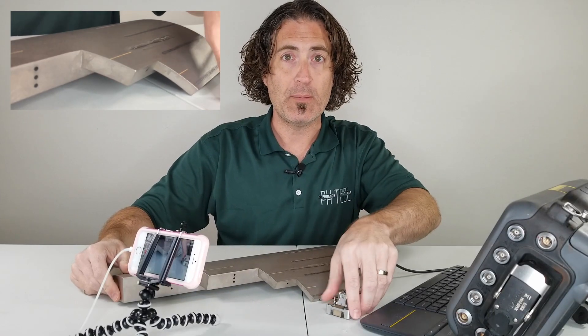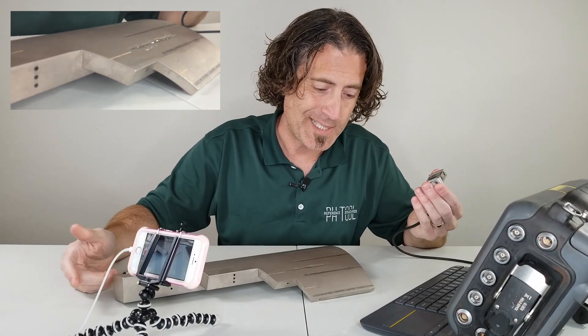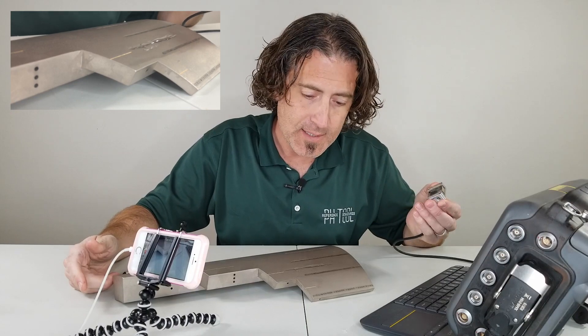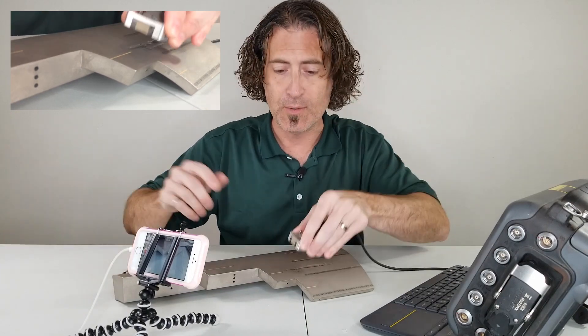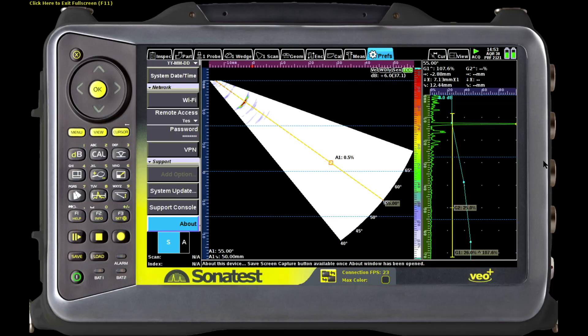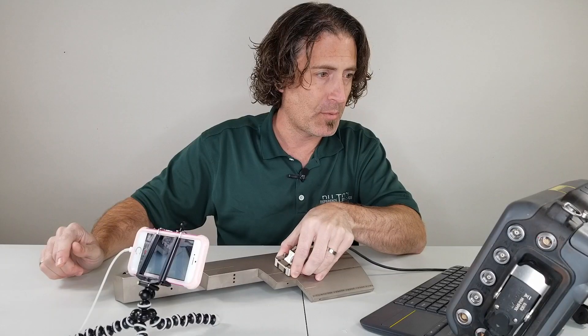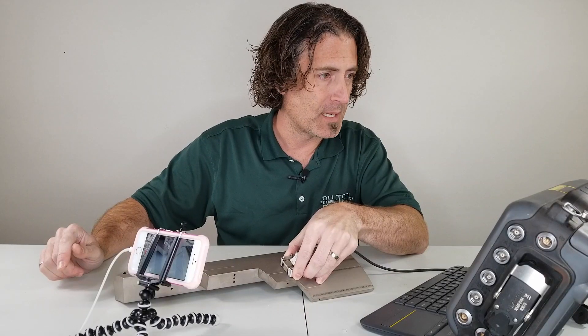I'll do a little demonstration of how the blocks perform. I'm putting the probe on the second sector, T2, which is 15.8 millimeters thick or 0.622 inches. I've conveniently already made a TCG. As I pull the probe back, you can see the hole signal on the first leg and there's no corner trap. I can make that corner trap appear if I turn the probe — there it is at the bottom — but it's not going to get in my way because I've angled that end.